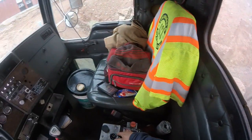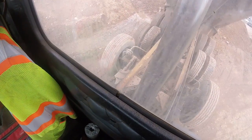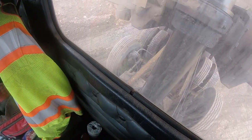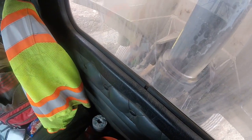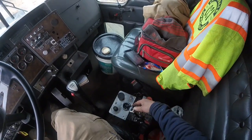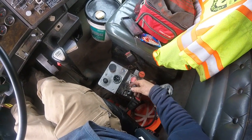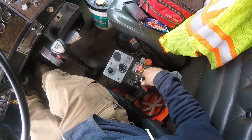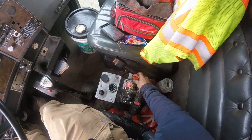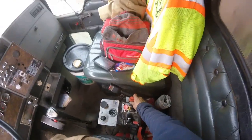And that's it. Then you always just immediately drop your body — drop that body. You don't want to drive with it up; you'll flip the truck. So there it is down here. Put it in a neutral position with the dump lever, PTO's out and all the way down. Lock the tailgate, and then you're off on your way.